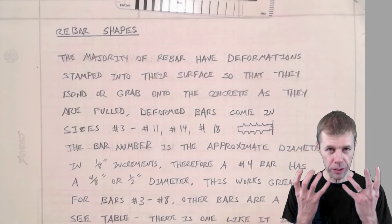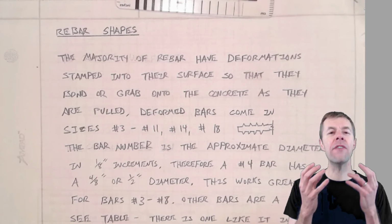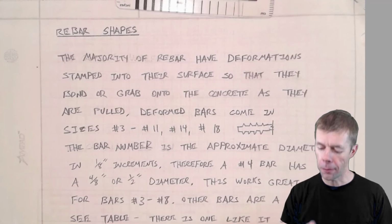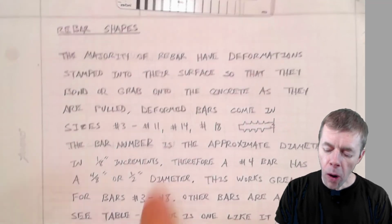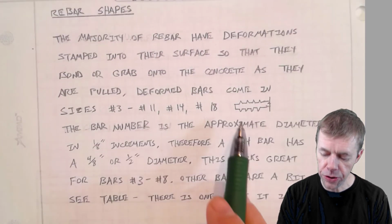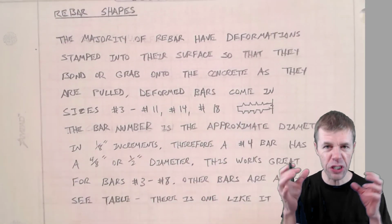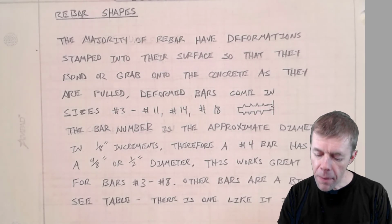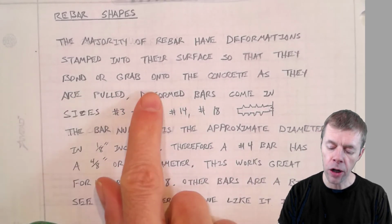So we talked about the properties of rebar. Now let's give you some other information, something about the shape. Rebars typically have deformations stamped in the outside. I'm trying to show some pictures here. Why do they do that? It's so that they can bond or grab onto the concrete